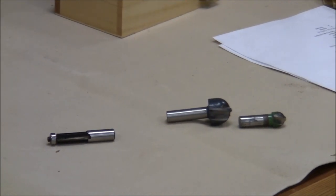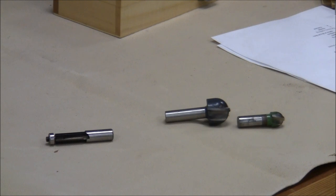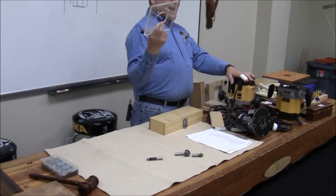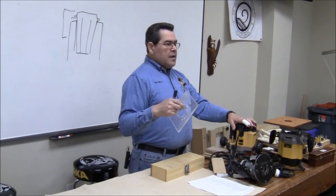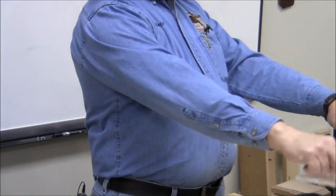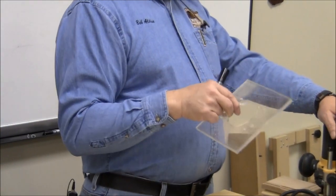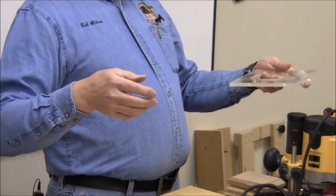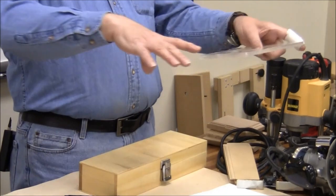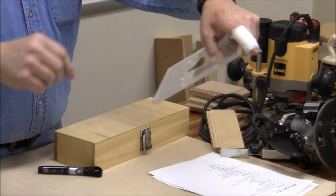For handheld use with an acrylic plate, as big as you like, as long as it's not in your way. This acrylic plate for the two-horsepower DeWalt was specifically made because I had a jig that it would ride in, but I could also use this handheld and see what I'm doing. You could make it bigger — they sometimes do for edge routing on a counter so there's no tendency for the router to tip. You can even add a handle so it isn't going to tip off the edge of your workpiece.